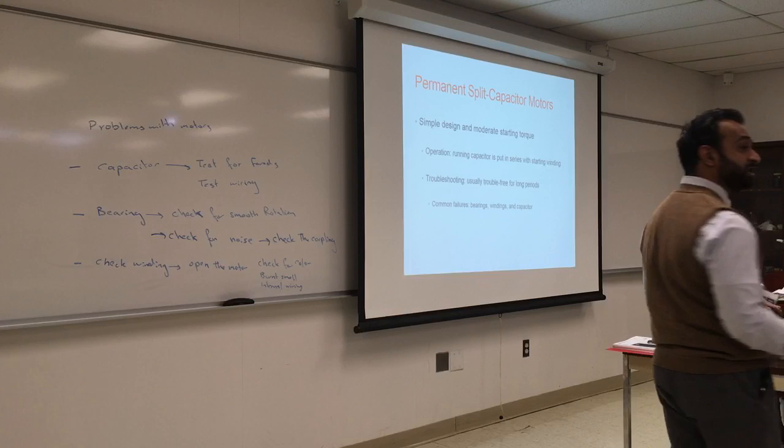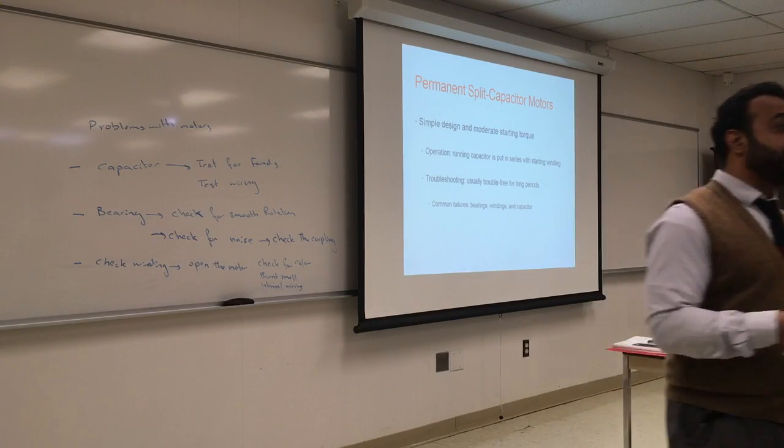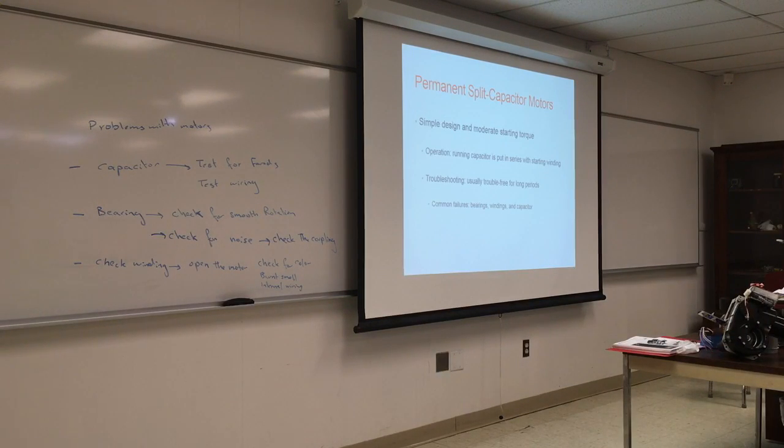So not because it's cheap. No, they want it to be very, very fragile, so it will connect with the right torque. If you exceed it, if the motor goes haywire, this will shred and protect your instrument. If you see a shredded coupling, make sure you investigate the motor, check the RPM, check the amperage, and check your pump. Something went wrong, that's why the coupling has shredded.